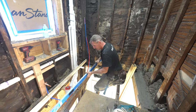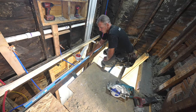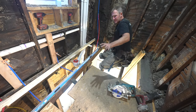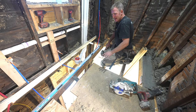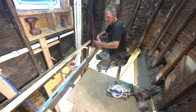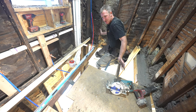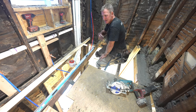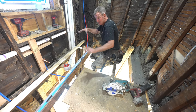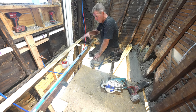I've got a six-foot level. I definitely recommend getting something fairly long like this so you can really evaluate the levelness of your bathroom. When it comes to rough-in framing, anything within a quarter inch is pretty good. You can be as precise as you want — the more precise you are, the better and easier it will be to finish everything off in the space.